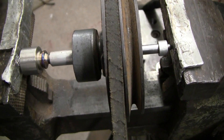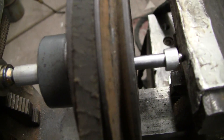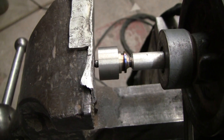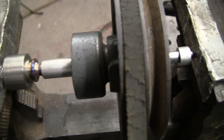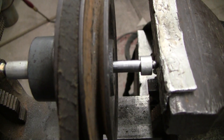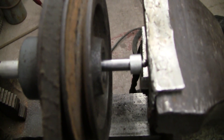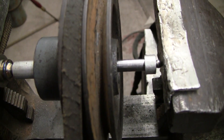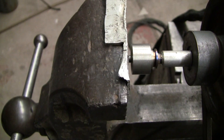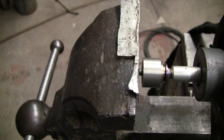And this is pretty important. It's supported by a ball bearing on each end that sits in a center hole — just a center drilled hole — in each end. This is a cap because this is a dowel pin that's hard, so I couldn't put a center hole in it. So I made just this little aluminum cap that has a center drill hole. And then this side is the hub that isn't finished machined yet, but I stuck a center drill hole in there.